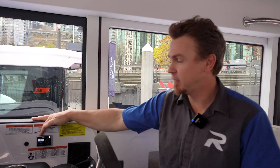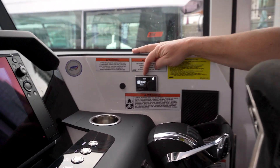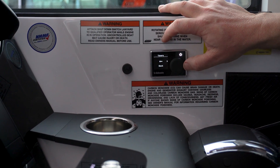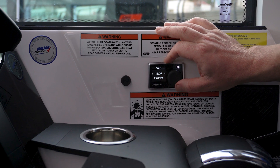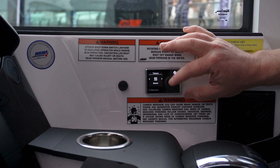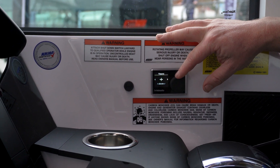We're in the main menu of the interactive user interface. The first item on the far left is the timers area. If you have your clock set — we're using 24-hour time and it's currently 3:18 — you can put timers in here. Today is Thursday, so let's set one up: a start time of 3:25, end time of 3:55, set it to boost mode at 25 degrees C.